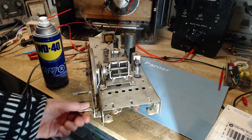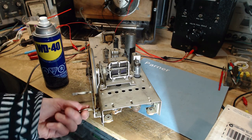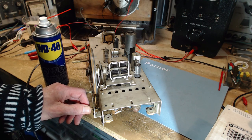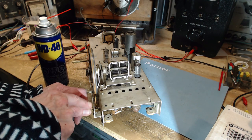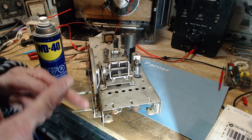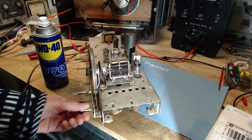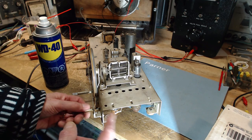And you get a feeling if you are examining a radio, say at a yard sale or something like that, and you tune it halfway across, and then it seems to not suddenly stop, but seems to tighten up. Probably the string is doubling here. Could be other things going on, but probably that's what's happening. And if you continue to force it, there's a chance the string will start kind of cutting itself. That's really not a hard thing to sort out, but this one doesn't have that problem because it has a whole flat run.